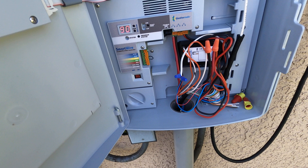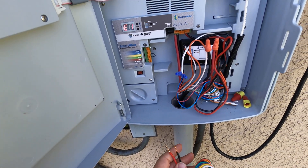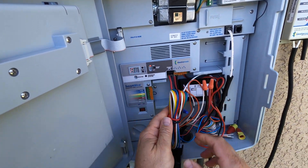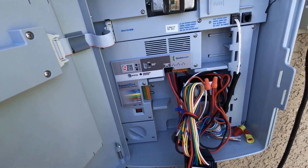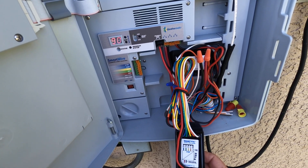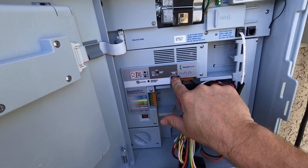What I usually like to do is disconnect the decoder and then plug it back in, just so I can confirm that it did in fact take the address that I programmed. As soon as you plug in a programmed decoder, it's going to show you the first output address. We now know that this decoder has been programmed and it's ready to use.